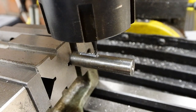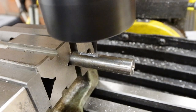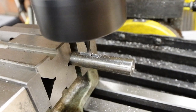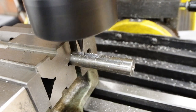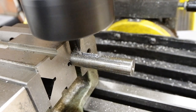A piece of 10mm bar for the main screw — that's going to need a keyway carved into the side of it. It's 2mm wide, 12mm long, and I think I made it about 3 or maybe 4mm deep. Using a tiny little carbide end mill, I didn't want to break it, so very light cuts backwards and forwards.